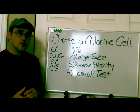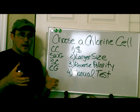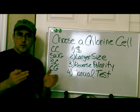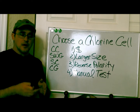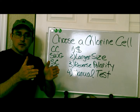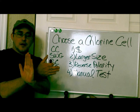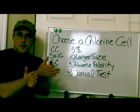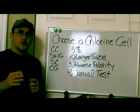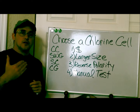Reverse polarity is a feature I really liked — we had it on the hot tub at the Y. Reverse polarity means that when one side of the cell is producing chlorine, the other side is being cleaned, and then it reverses. That said, it doesn't mean you don't have to clean the cell manually; regardless of what anyone says, you still have to clean it, just not as often.